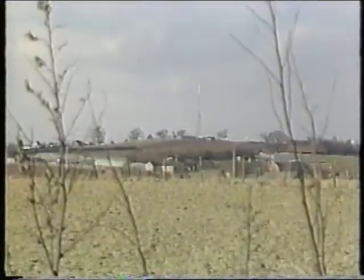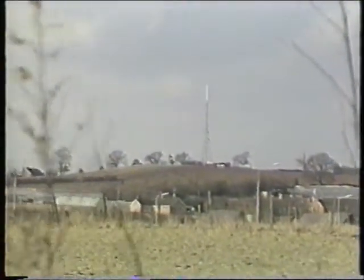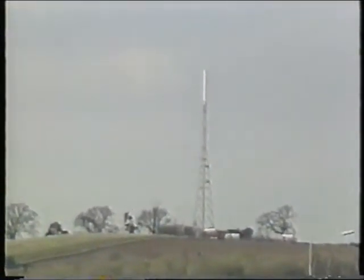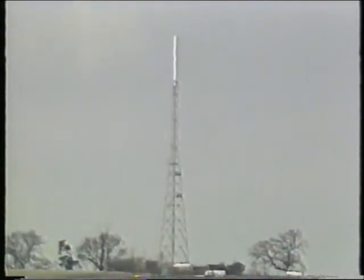New low-power relay stations are being added each year. The equipment in use at low-power relay stations therefore depends on power level and date of installation. This UHF relay station at Bronze Grove receives and transmits the four television channels; all four services have approximately the same ERP, and the viewer requires one receiving aerial for all four programs.